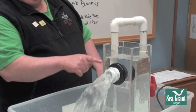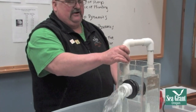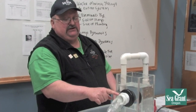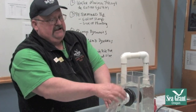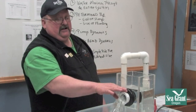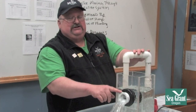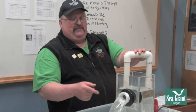If this was your tank, you could probably run this pretty safely. That noise is a siphoning effect that occurs, and that's why instead of going just two inch, you might even want to go up to the next size — two and a half inch. Now you're safe. If something clogs this opening, you'll still have room to prevent overflow. So a good basic rule is: whatever size is coming in, you double the size going out. If I have a one inch line coming in, I do a two inch opening going out. And to be safe, go up one half inch farther — so two and a half inch.